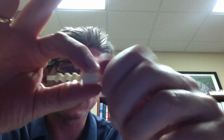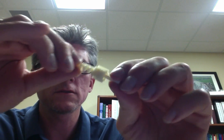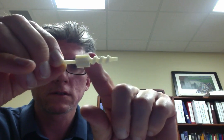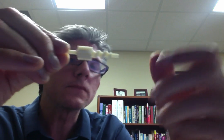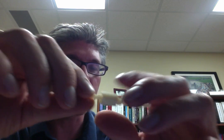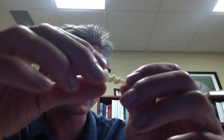It's not as good — there's still a lot of sliding friction, I can't really spin the nut out. Well, actually, not too bad. It doesn't really spin out like it would if I had a well-machined metal lead screw, but it's not bad. So I think that's what I'd recommend: if you want to keep the pitch such that it's at least a quarter-inch pitch, the 60-degree face angle — the tooth angle — is not bad. But I think the important thing is to have at least 20 thou diametric clearance, maybe even a little bit more — maybe 20 to 25 thou. And the more I work this, I'm getting a little slop in it too, but I think that's pretty reasonable for our needs.